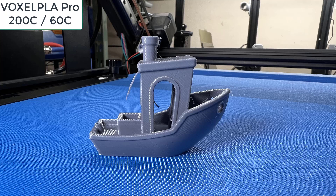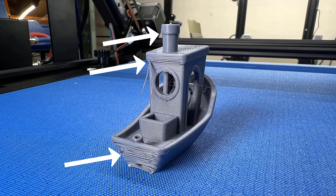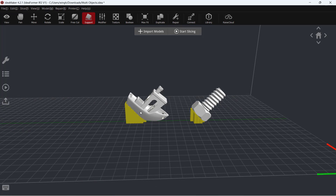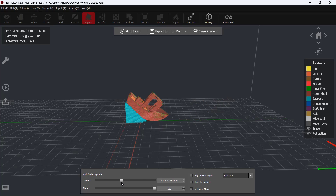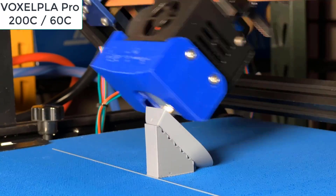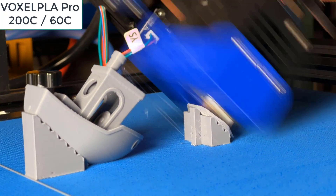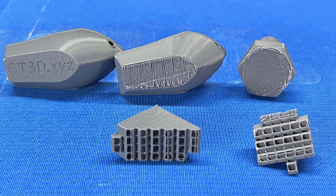As expected, the Benchy did not turn out great. Next, I will print the Benchy again as well as this bolt at a 45-degree angle, so I would just add support at the bottom to form a base in order to enable this printer to print at its original angle. As you can see, the Benchy and the bolt are printed just as nicely with this printer as a normal 90-degree printer. Of course, you still need to remove the support at the bottom, just like how you would remove a raft from a print on a normal 90-degree printer.